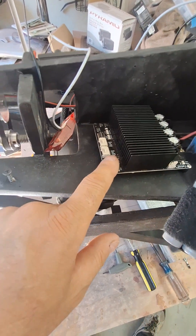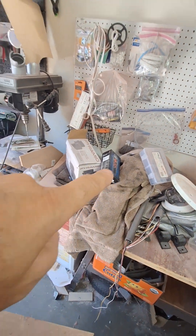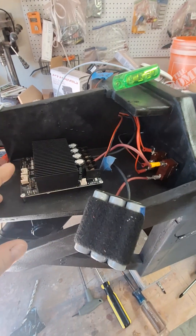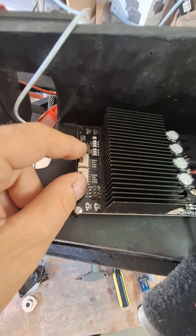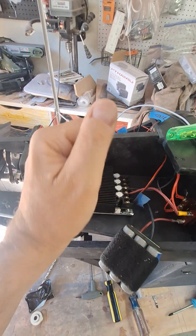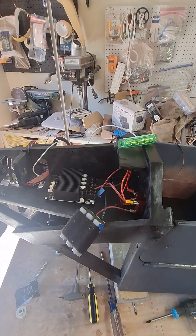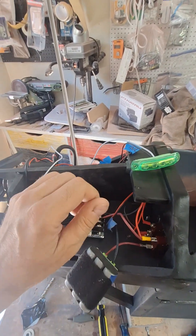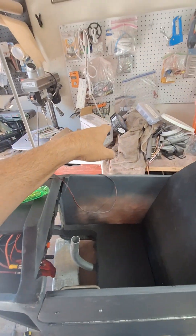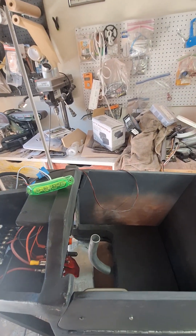When you're done, there will be a remote control input that goes here — that's what is going to operate it. The receiver is going to plug into this. You also have the ability of switching to analog joysticks. Analog joysticks have a tendency to be really jumpy. Remote control ones can be tweaked down using the exponential programming that I can dial down, so that's kind of why that's there.